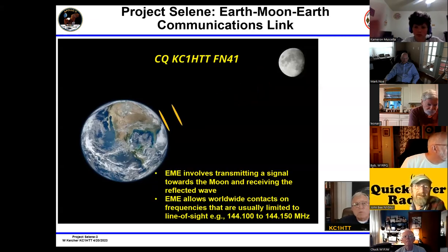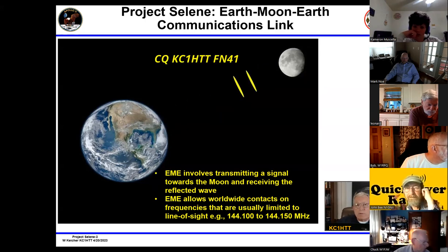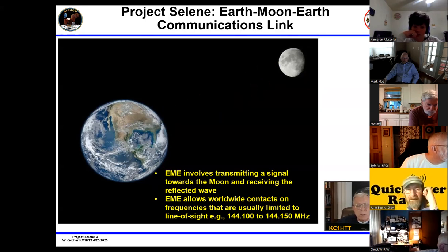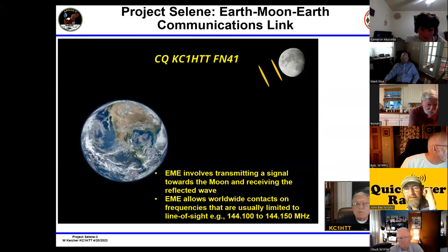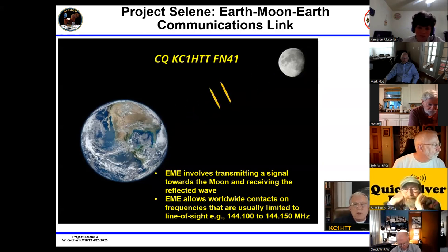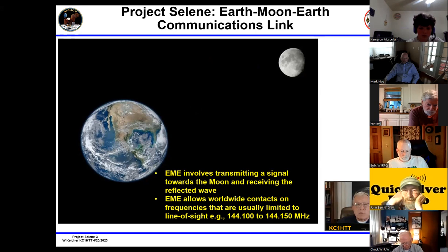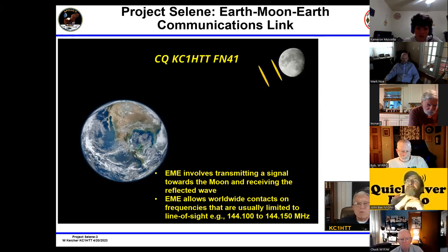This shows very specifically what we're talking about. We're transmitting a signal from Connecticut, going roughly 240,000 miles to the moon, reflecting off the surface like a radar signal. The total round-trip travel time is about 2.4 seconds, which can vary because the orbit of the moon is elliptical instead of circular. We're going to be talking about operating at two meters, roughly 144 megahertz. That's where most people operate with small stations, though there's a lot of effort going into X-band or 10 gigahertz, which is much more difficult.